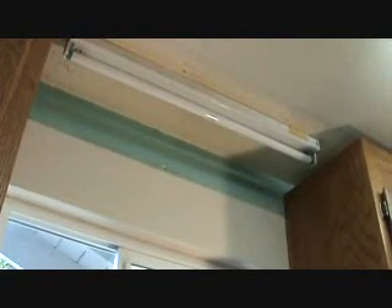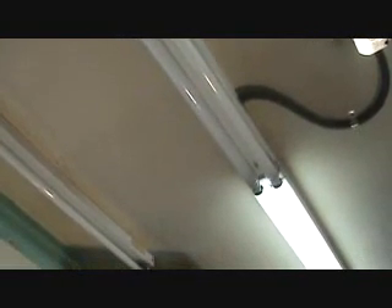Now, if you have four-foot fluorescent light fixtures and you want to put in thinner T8 bulbs to save on electricity, you'd need to retrofit your light fixture. Usually what you do is take it apart, then change out the ballast — that black rectangular heavy piece of material with wires coming out of it inside the fixture. I'll show you that when I get ready to demo this.